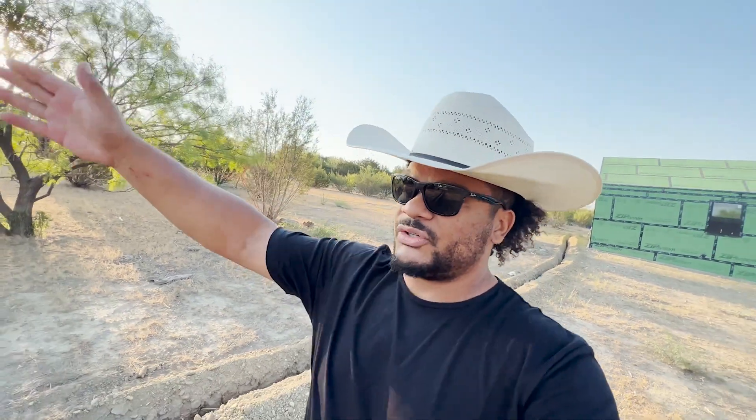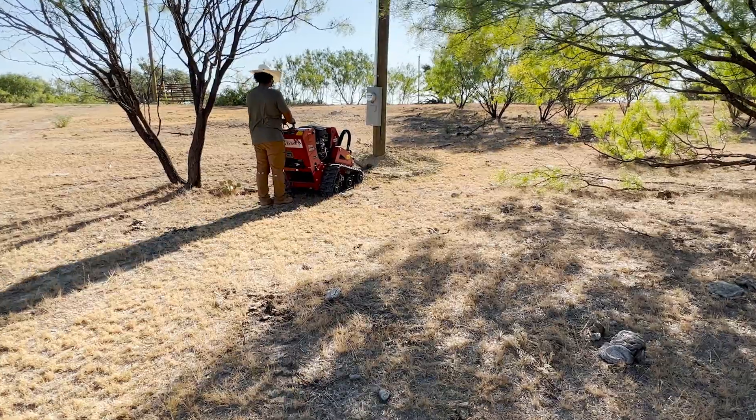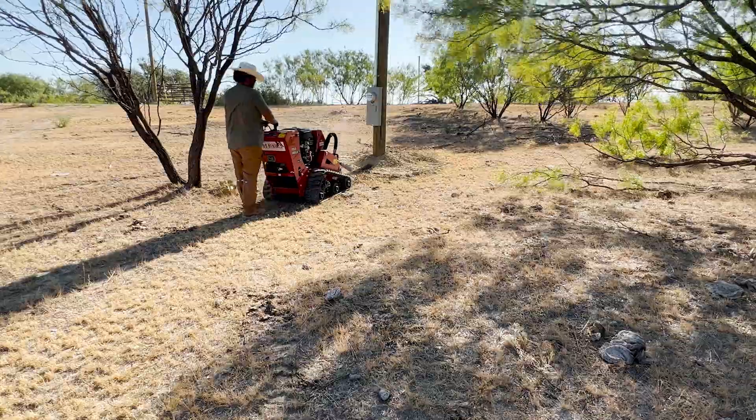We're at 200-amp service. We're going to be running conduit in the ground versus stringing a line from the pole and fastening it to the house. I prefer the ground — it's cleaner, you don't see it, no overhead wires, out of sight out of mind, and it's really clean bringing it up to the panel. I trenched about 24 inches deep from the service pole all the way down. There is a code minimum depth here in Texas — 18 inches deep to the top of your conduit.